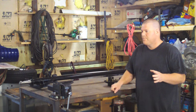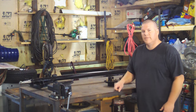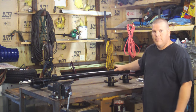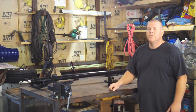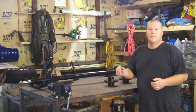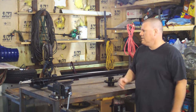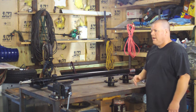One of the first things I wanted to talk about is getting your axle ordered before you even start. I like to get it in my hands so I can measure my spring centers, which will determine the outside frame dimensions. I've got a 3,500 pound axle with no brakes. It's 58 inch spring centers, which means the outside dimensions of our trailer frame are going to be 60 inches — 5 feet. I got the axle first so we can make it perfect.